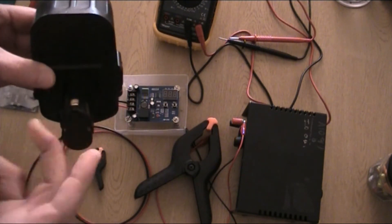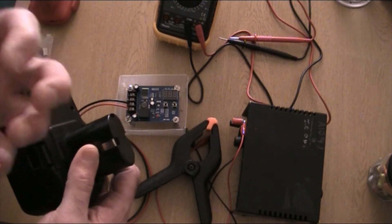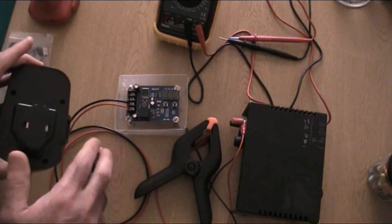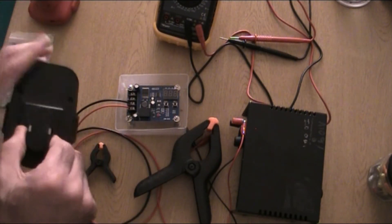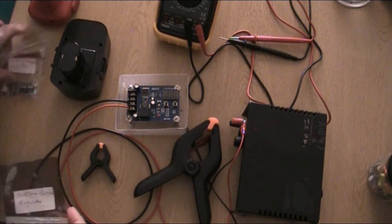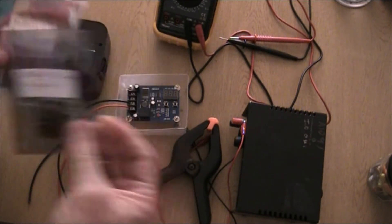As long as your battery has only two functional connections — whether lithium-ion or nickel cadmium — this regulator will work. But if you have more than two or practically three actual connected plates or slots that connect to the battery charger, and your original charger doesn't work, you cannot use this type of regulator. With this you only have two connections: positive and negative. For those batteries you have to connect to all cells, and for that I have two different battery regulating boards I'll introduce in my next video.